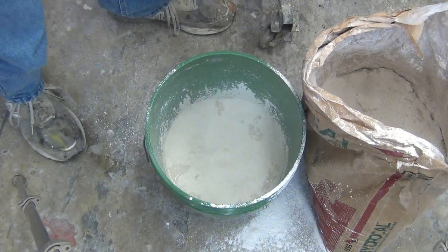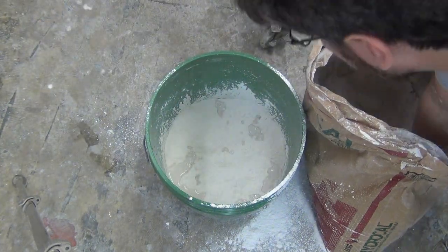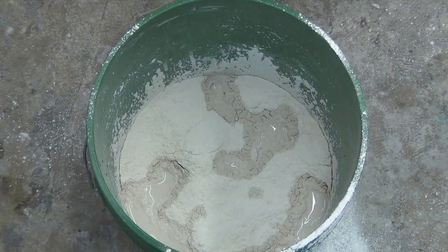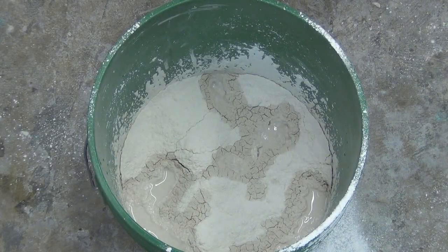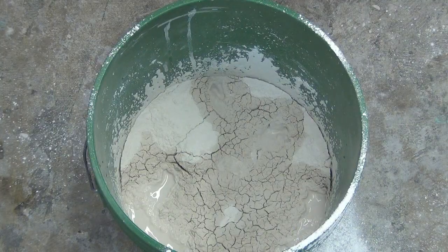And that's the saturation point where our water has absorbed as much Hydrocal as it can. And that's key to getting a good strong end product with Hydrocal. It's very tempting when you're starting out to put a little bit of Hydrocal in, stir it up, add some more, stir it some more, add additional, stir it some more. And the problem with that is you wind up with several distinctly different batches setting up within itself, and you'll have cracks and little fissures forming later on, and you won't have near as strong of an end product.